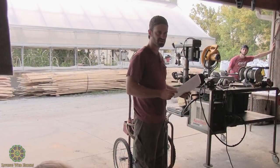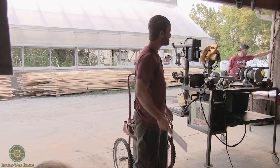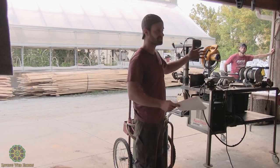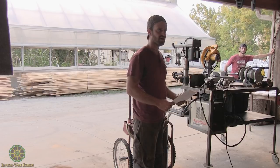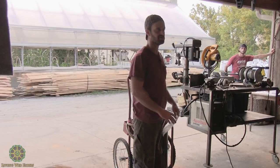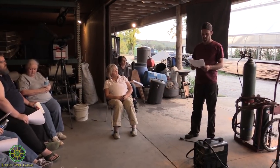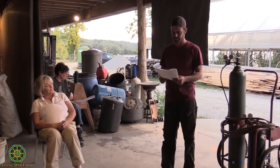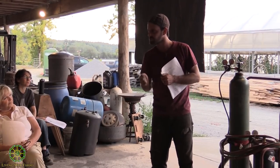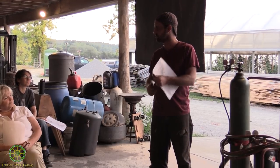Too little or too much shield gas is an issue with the MIG welder. I'll show you that. That's similar to what Evan was talking about. If your electrodes are exposed to humidity, not even wet, they'll be damaged. It's crazy. The big guys keep their electrodes in an oven to keep them warm, or in a dehumidification chamber. Then there are improper settings on the welder and improper selection of wire. Sometimes, and I'll admit I don't have a really good feel for this, it's better to push the bead than to pull the bead. I'll explain what that means when I demo the welds.